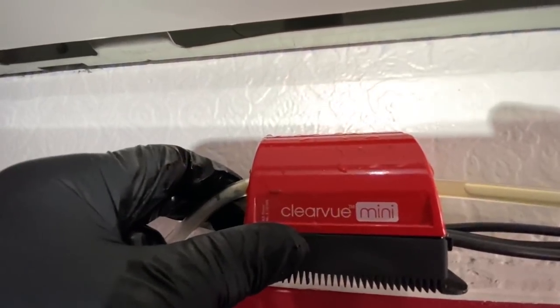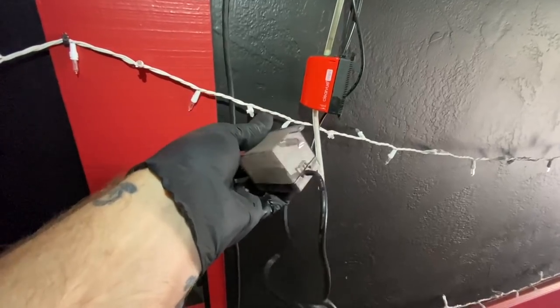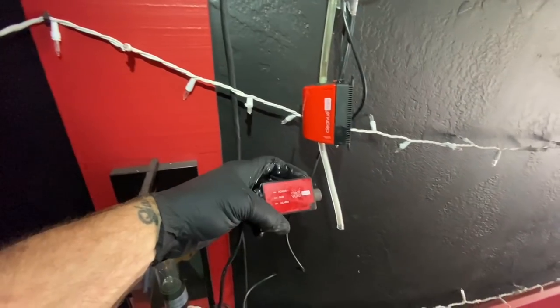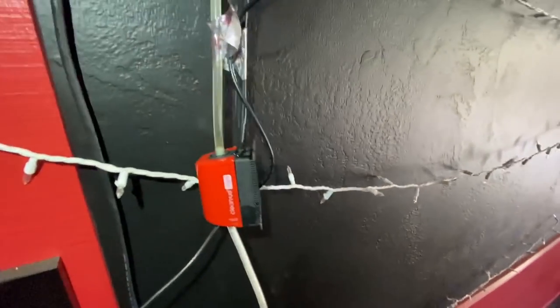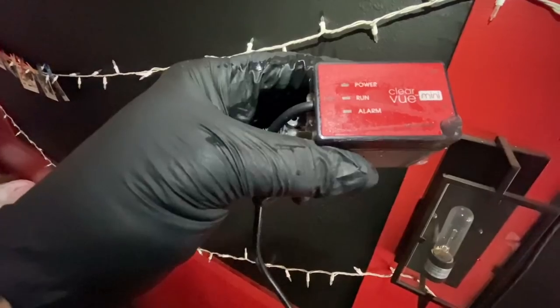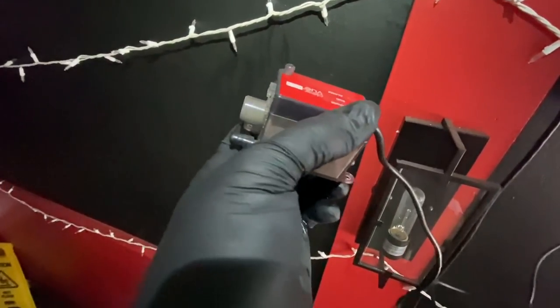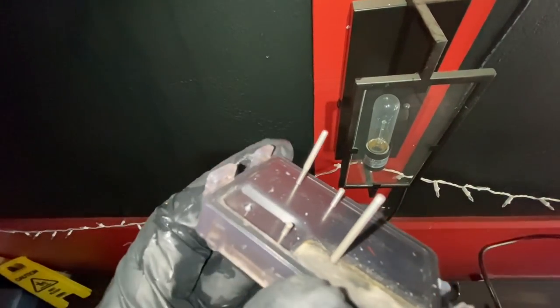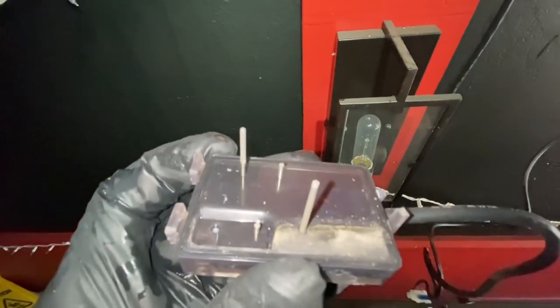All right, here is the condensate pump. I'm going to let that hang down there like that. This was the float. It goes connected to the condensate pump. We could check the LEDs on it. I've got it unwired right now, we'll wire it back up. And that one sits in there like this. What I noticed is, I'll take this off, one of the probes looks pretty scaled up. That probe right there. This one. I'm going to shine them all up and see what happens.